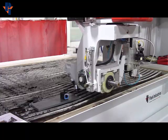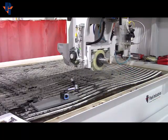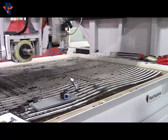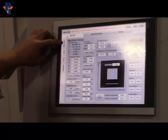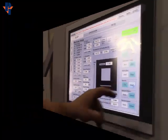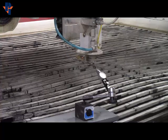Once that's done, drive pretty much directly straight up. I always use the slow button until I make sure I clear everything. Once you clear the dial, you can drive back and across. Once you're in a clear position again, you can drop the nozzle. Drop the nozzle: hit setup, go into the setup tab, hit jet setup enable, then go to nozzle and hit down.